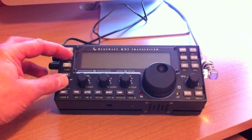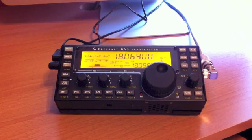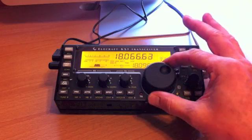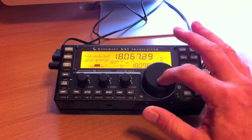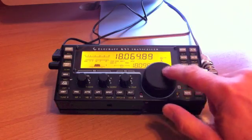Let's push these two buttons and turn it on — there we go. We did the smoke test last week and everything went fine; turned the power on and everything went well. As you can see, the VFO knob here is a bit stiff. I have to do an adjustment inside with an allen key to raise the knob up a bit so it's not quite as hard to turn when you've got your finger in the dimple.